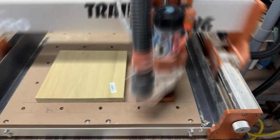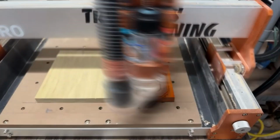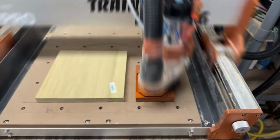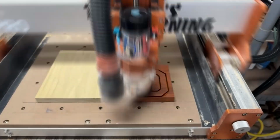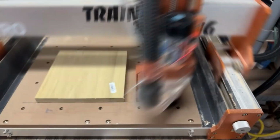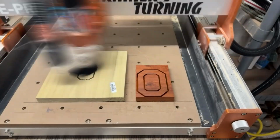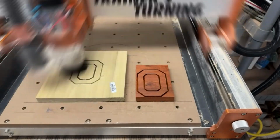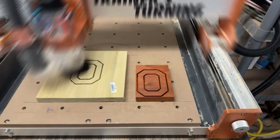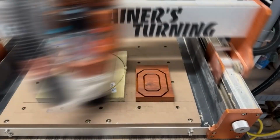So a while ago I made an Ohio State University themed inlay bowl, and it turned out, but it had some issues, and it was mostly with the wood I used for the base. The piece of honey locust I used was really close to the center and developed a pith crack when I was inlaying it, which I glued up and was not that big of a deal, but the wood itself was also kind of an orangish red, and it didn't really contrast very nicely with the Padauk.